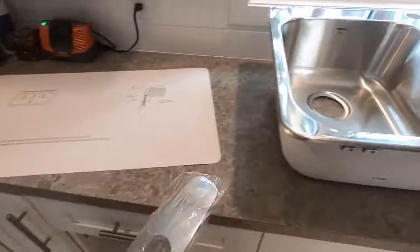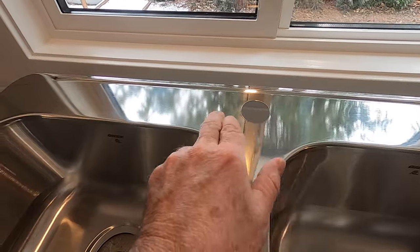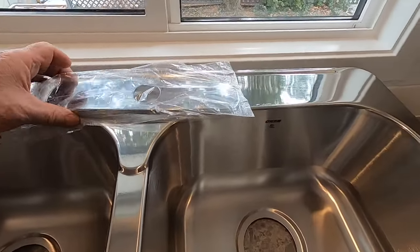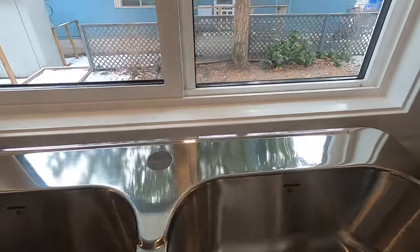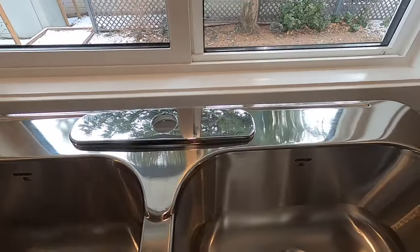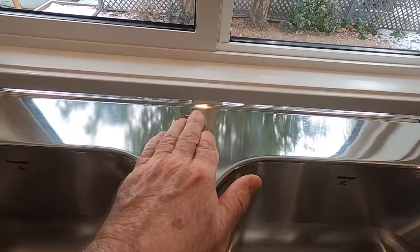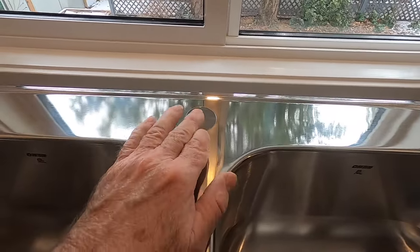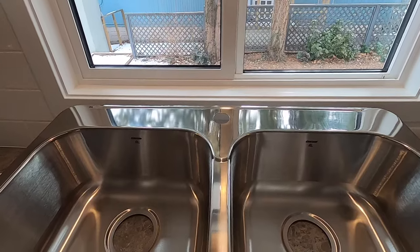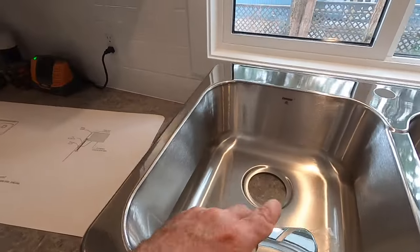If you're doing a retrofit you might have a sink with three holes where you've got two taps or whatever. They also include a trim piece in the box that would basically cover the other holes. But it's a big clunky thing and we don't really need it. We're going to eliminate that plate and just have the tap going down into the one hole — it gives a much cleaner, more high-end look. A little tip: if you want your installation to look nicer and more upscale, try to eliminate that plate and go with a one-hole sink.